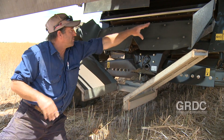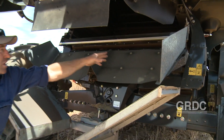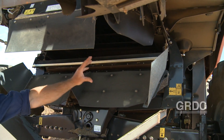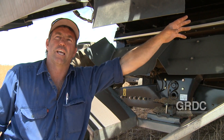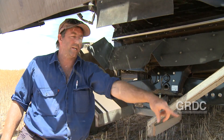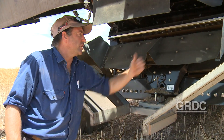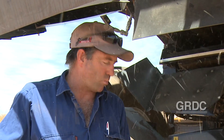We really haven't done a lot more, except we've put a bit of tin on the side of the shaker tray. That really is for the light grain — if you've got a long, windy crosswind, it can blow the fines out to the side. We really have not seen it affect the job or more weeds growing outside the width a hell of a lot. But you see all the more trash going into the windrow, so it makes you feel better basically. Weed management is going to rule farming. It's that simple.